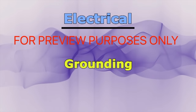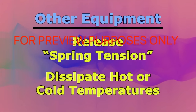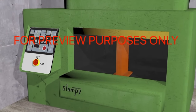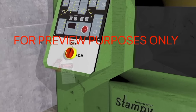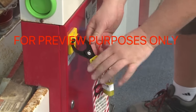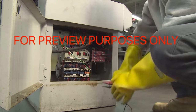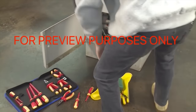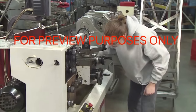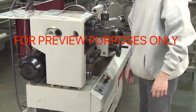Various types of equipment may require you to release spring tension or dissipate extreme temperatures as well. After getting rid of any residual energy, you may still have to block off parts of the machine that could move while you are working and install additional lockout/tagout mechanisms to complete the lockout. Once you have performed all lockout/tagout and energy dissipation procedures, test the machine to make sure it won't operate. For electrical systems, use a voltmeter to verify no electricity is flowing. Press all start buttons and throw all switches that would normally activate the equipment. After confirming lockout is working, return all switches to their off position, then work can begin.